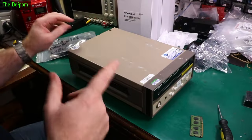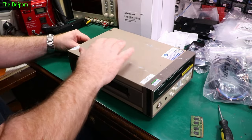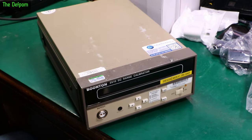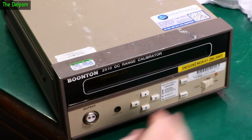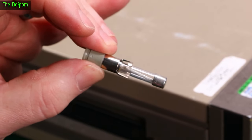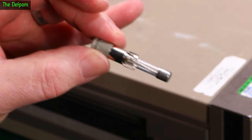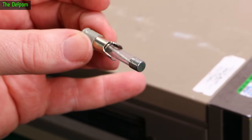Should we power this up now and see if it goes, or find out if it's got any magic smoke coming out? I think I've got the voltage right. Let's find out — power switch off, no power draw in the off state. Turn it on... That instantly died. Did I blow the fuse already? Yeah, that fuse blew — you can see there's a dark area just inside the hole. That was either just unlucky, there's a problem with the unit, or the voltage selection isn't right. I think I'll look into this a bit further later on and move on to the next thing.